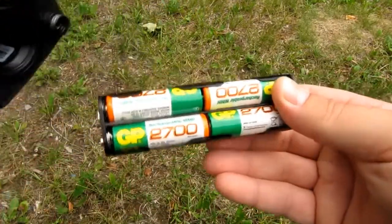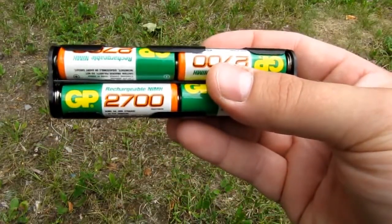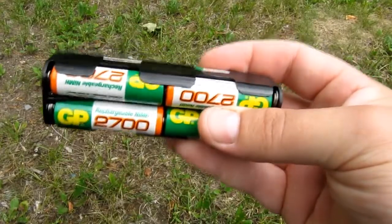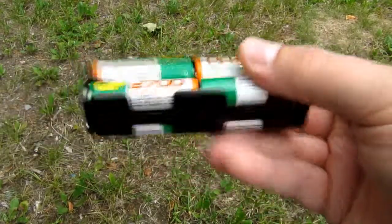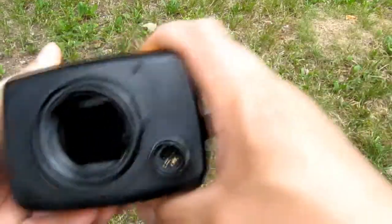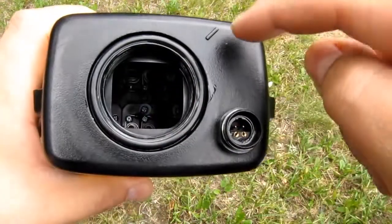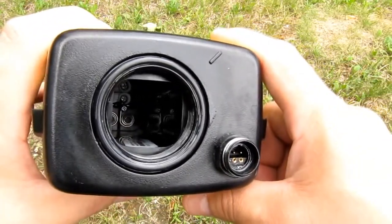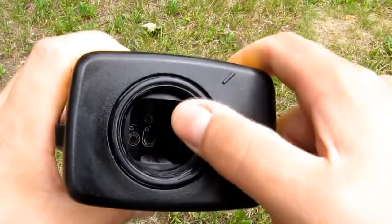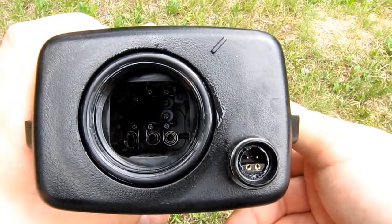And this is a pretty standard battery pack, 8 AA batteries. I'm using rechargeables now, which give this detector really good battery life. The manual says 18 to 22 hours. That's probably pretty accurate. The housing itself is protected, so if this cap fails and water goes in the battery box, it won't go further than that. It has been sealed, so the water does not get in the main electronics housing.